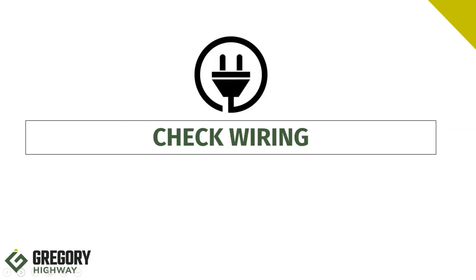Check wiring. Check to make sure that the wiring of the trailer plug for connection to the tow vehicle is appropriate. There are two distinctly different wire plugs that are not compatible. One is the RV plug and the other is the heavy-duty truck plug. Make sure that you have the correct type of plug and that the plug is wired properly. Also, check to confirm that the lights are functioning properly prior to putting the TTMA 200 into service. Consult your user manual for wiring diagrams and other helpful wiring related information.